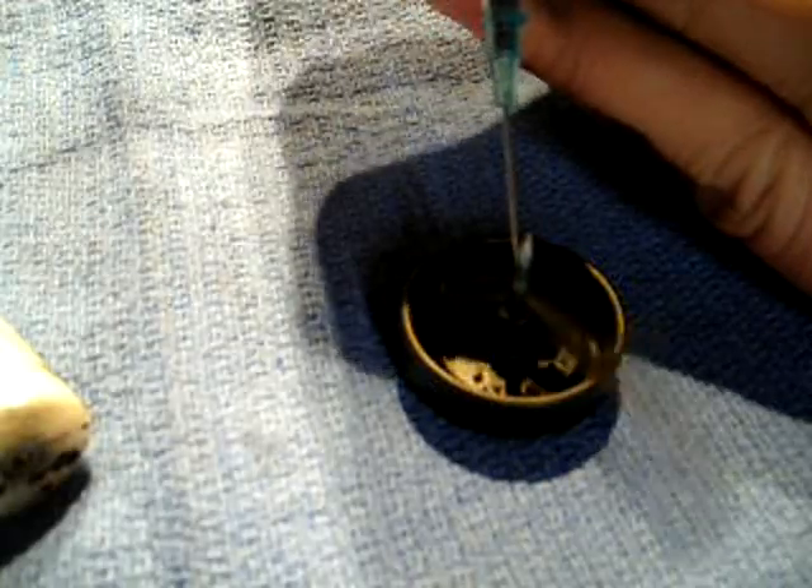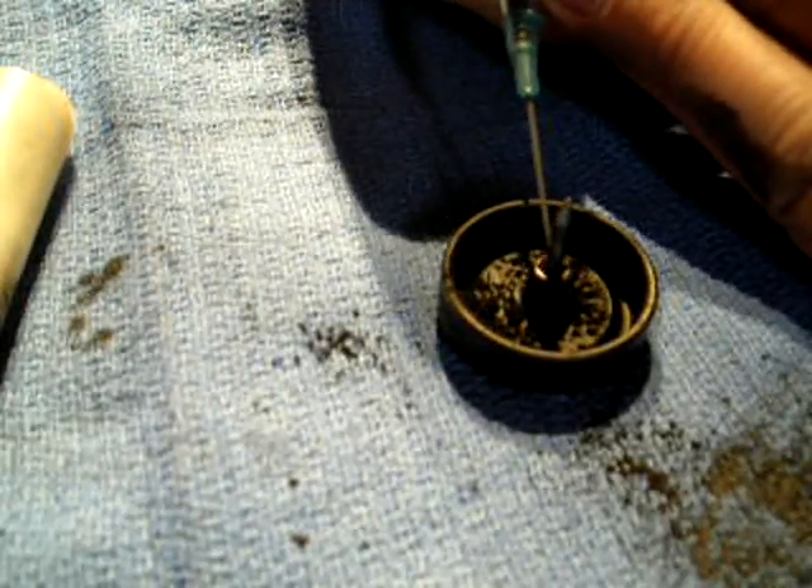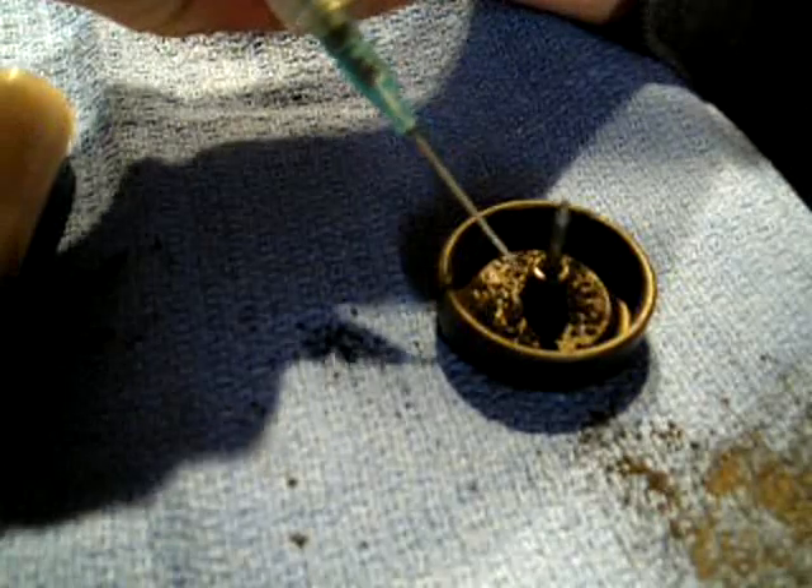We continue this process until I get the desired firmness around the hub. This isn't any ordinary graphite — this is actually industrial grade lubricant. It is 300 mesh. The local guys get up to 200 mesh, but 300 mesh is much finer, easier to pack, and it will stay nice and firm. It is almost the consistency of talc — pretty fine.